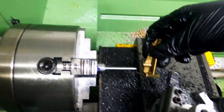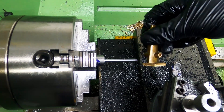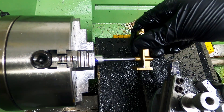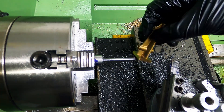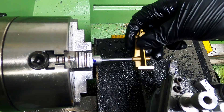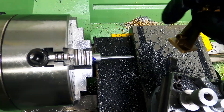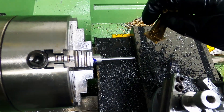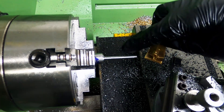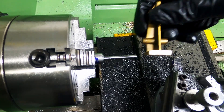I've turned the very end down. It only fits in one side — actually, it does fit in both. I set a zero on the cross slide just to get a dimension, a visual for what I'm aiming for, and then I'll slowly take down the rest bit by bit until this slides on.